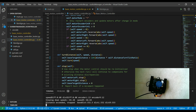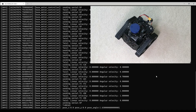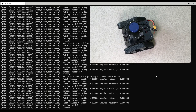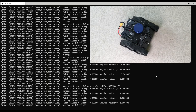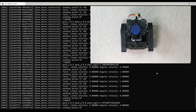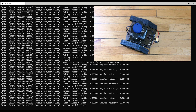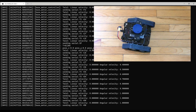Moving a distance and turning a distance — especially turning — isn't 100% accurate but it's close enough. I got curious why turning seemed harder than running a straight distance; the motors weren't working as well during turns. I ran an experiment using the joystick on carpet: it was jittery, hard to start, and didn't turn as fast. Then I did the same on a wood floor — much less friction on the tracks — and both turns were faster, more responsive, with the joystick working at slower speeds too.